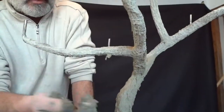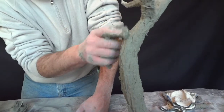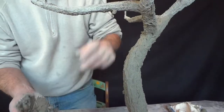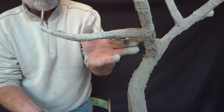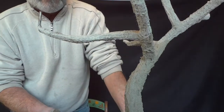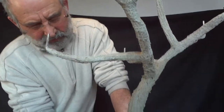I mean, all you gotta do is rub it on, and you can see how I'm creating the texture. All I'm doing is just touching the concrete. First you have to put on your cover layer. This has to be what they call surface saturated dry, which means that you've got to soak it real good and then let it dry. Basically, it's a dark gray but not glistening. Okay, because if it's glistening, that means there's water on it and it's going to dilute your stuff here and it's not going to work very well.